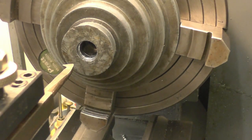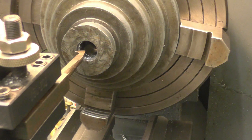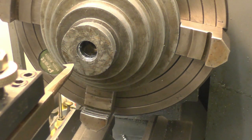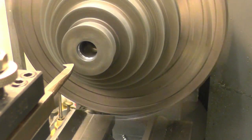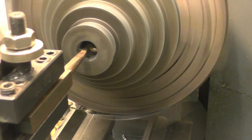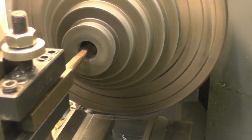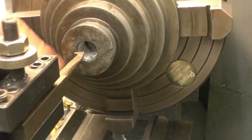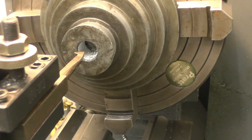I've found a nice little high speed steel boring tool - it will get nearly all the way through. All I want to do is bore it out big enough to get in my carbide tip boring tool. It's just aluminium so it's nice and soft. I'll put a power feed on so I get the best finish I can with it.